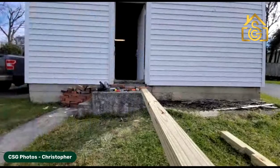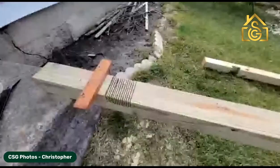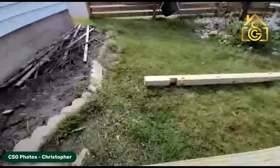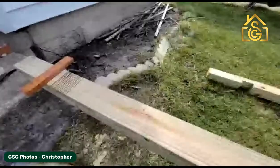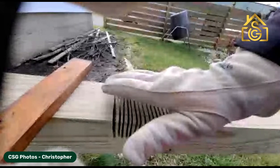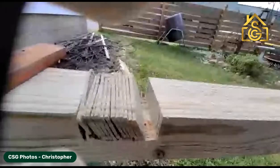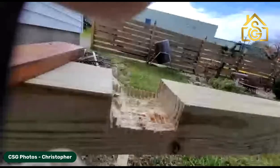I'll give you a look at what I've done so far. Using the skill saw, I've created these notches so that I can notch this out — similar to this board here, you can see how that's notched. They will fit nicely together and create that leading arm that the sign will be able to hang from. Once these are notched like this, we just take this pry bar, put it in here, and pull those notches out all the way across. Then I'll bring the chisel in to clean the rest of these up.